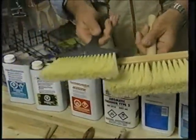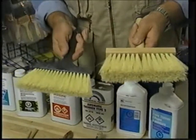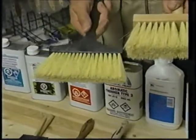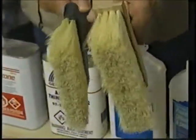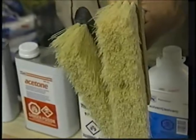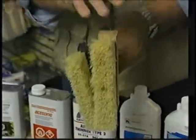Here are a couple of brushes that get misnamed. A lot of people look at both of them and say 'that's a whitewash brush' — well, this is truly the whitewash brush, and this is a masonry brush. The whitewash brush is narrower in the bristle; the masonry brush is much wider. That's because of the type of texturing and finish you're applying — cementitious or cement-type products mixed with water — for painting stucco, concrete walls, or texturing concrete patios, driveways, or sidewalks. They can be used for the same thing; it's just that one is a little more qualified than the other.